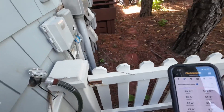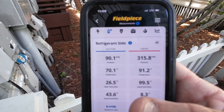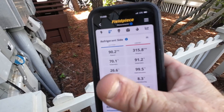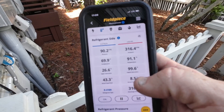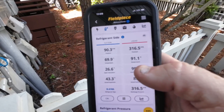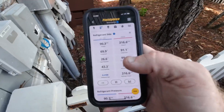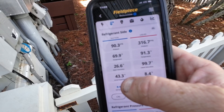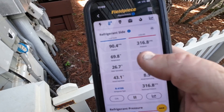The reason why I think it's a TXV is when I look at the gauges — it's slowly climbing. The suction side usually means an indicator on the inside unit, and the high side usually means an indicator on the outside unit. If your pressure is high and your subcool is low, you probably have a clogged condenser coil. And vice versa — if the suction is low and the high side is high, then you've got airflow restriction on the inside, which is probably the TXV clogging it.